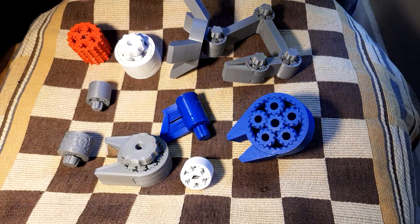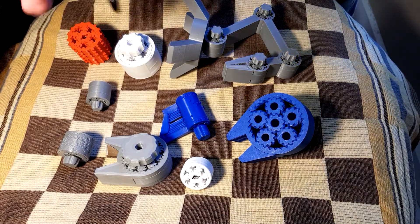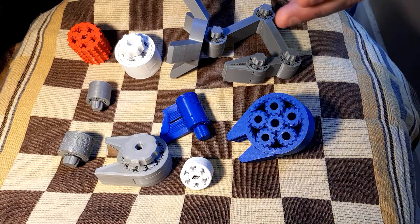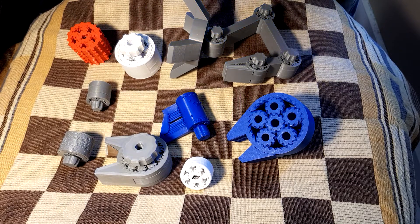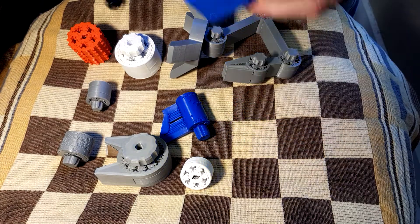So as an example, instead of starting with a valid planetary arrangement with three planets and stretching one of the ring gears by three for the second stage, we could in fact start in the middle, where we only need to compress the primary and stretch the secondary by one tooth in each ring, keeping the same radius, resulting in less distortion overall for a similar result.